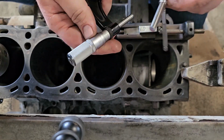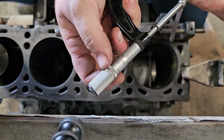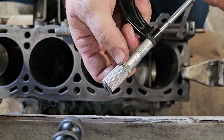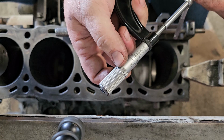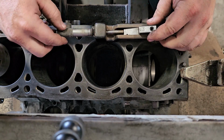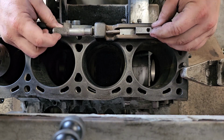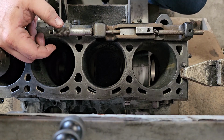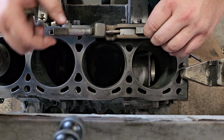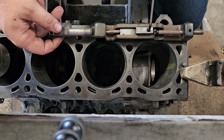So then I'm going to take my 4-inch micrometer, roll it out. So I know with a 4-inch micrometer, I'm going to have a 3-inch minimal diameter. And that measures 6, 25, 30, 31, 32, 33. So 633. That's what that bores at. So then I'm going to want to set this at 3.633. So I take, where's this tool at? Is it this one? No, it's not that one. Is it this one? Yes. That's the tool. So as you can see, that kind of springs. So I want to go to 633.